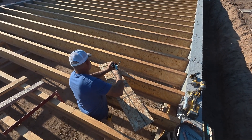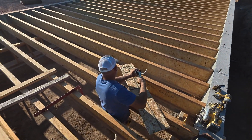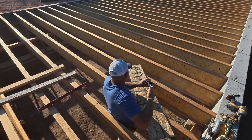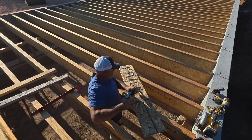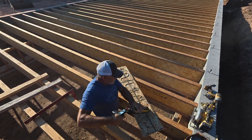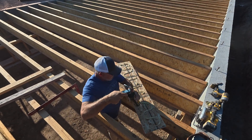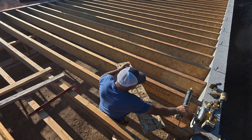We're going to put this three-quarter inch sheeting in right here to just stiffen these joists up. You don't want to cut them too big or too wide to fit in the joists, or when you go to slam them in they'll break your joists. We made them just perfect — even a tad small would be fine.